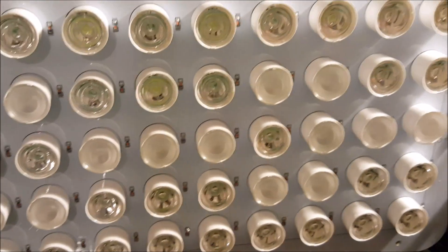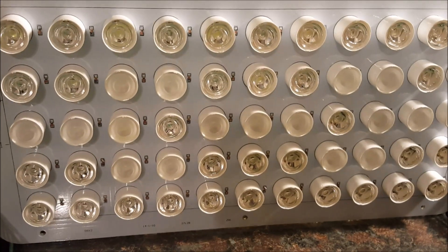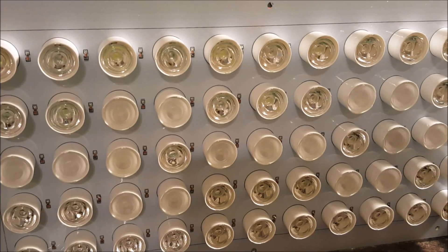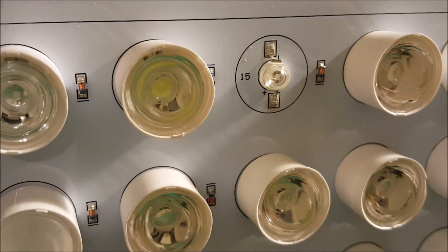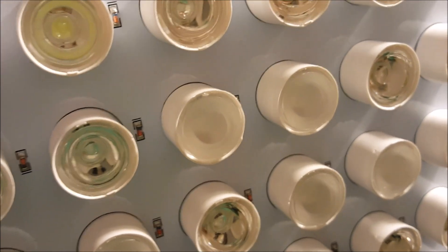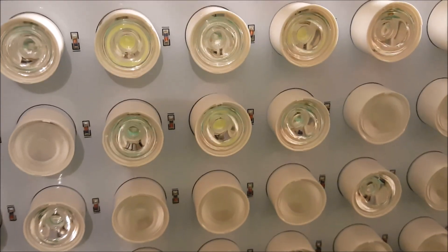This board has more 420nm than anyone else, plus true UV at 395 nanometers. One problem with true UV is that the plastic lens under the optic gets worn out within six to eight months by a standard UV diode — even 420s burn through pretty quickly. What we've done on our UVs and violets is use a silica lens instead of plastic, so you'll get a lot more life out of those without having to replace them. Just a much better built board overall.